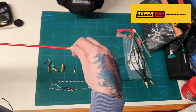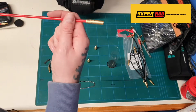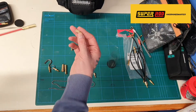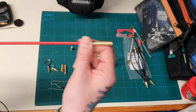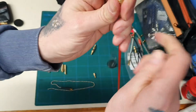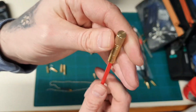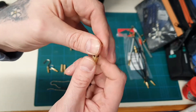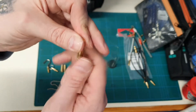A lot of thought has gone into these accessories — they're not just little gimmicky things. They've really worked with tradespeople to get an idea of what people require on the job. So you've got your dome bullet and your flat bullet. This one is for when you're going fishing through plasterboard or false walls — if you get any debris or material, this is just going to block up the hole to keep it clean. A lot of my old rods I haven't done that, and you've got all crap and debris caked in them. That's a really good idea — it gives longevity to your rods. If you're paying 70 to 80 quid for rods, you don't want to damage them within the first couple of days.